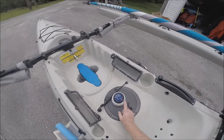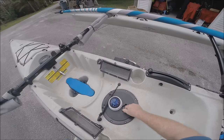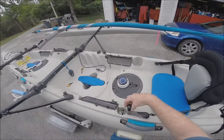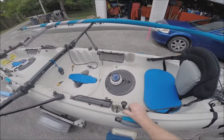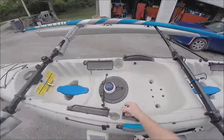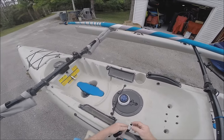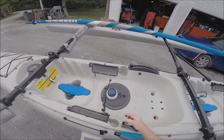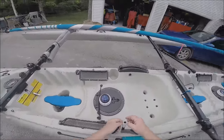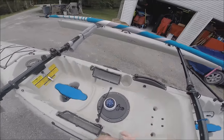The next alteration I did is to mount compasses on both of the cockpit cubby hole hatches. I do recommend the wheel accessory you can get from Hobie to add on to the tiller. On the front one, I've used the bolt from the knob and glued and epoxied the bolt inside a piece of fuel line. On the other end of the fuel line I put a piece of half-inch schedule 40 PVC pipe. That way I can attach a shaft and another PVC pipe to create a hiking stick to sit out on the trampolines and control the tiller from there.